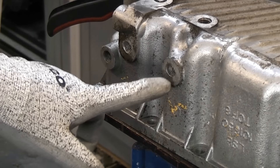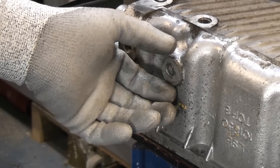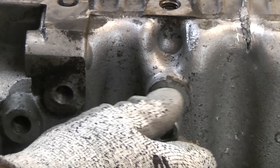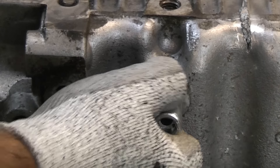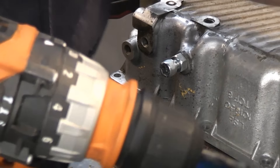In this video I've got a bolt which is sheared in this hole, and what I'm going to do is shear off a tap in there and then we're going to try to remove the sheared tap. I'm now going to put the guide in which I've made and tighten off the nut at the back, then drill that out with the correct tapping sized drill.